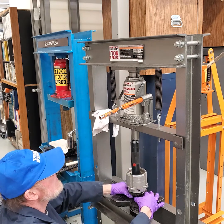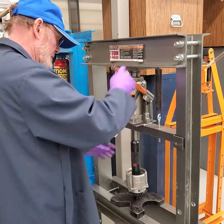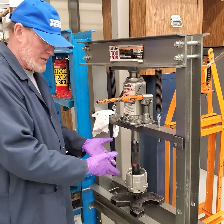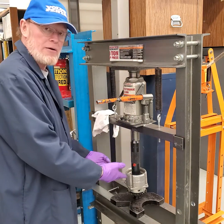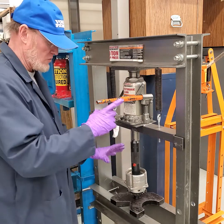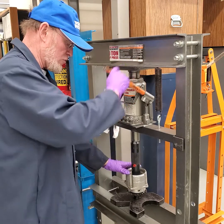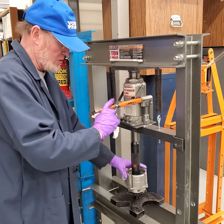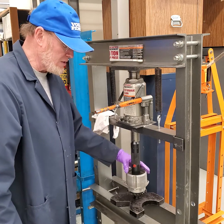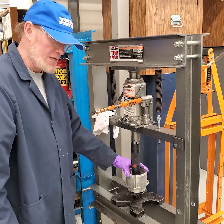Take the extra moment to center it. Tighten your press up and then start pressing the bearing. Don't forget the bearing has to face taper down, and the other bearing faces taper up — so do a little checklist. Don't rush through this; take your time. Once that bearing starts to press on, what you want to do is press that bearing down until you can just take the rock out of this housing.